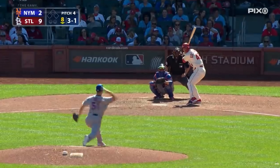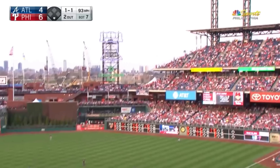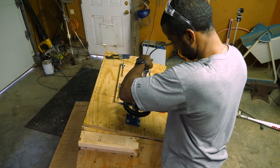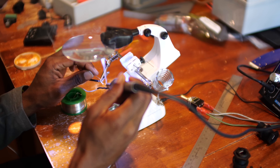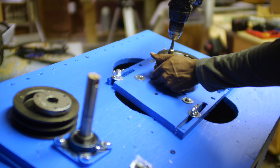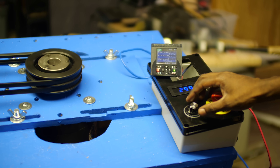We know that major leaguers swing the bat at about 90 miles an hour and so you get this exit velocity that's really high - a hundred something miles per hour. We have devised an apparatus. My buddy Jeremy Fielding has been working on it for months now. We've got a three phase generator hooked up to a huge motor and a pulley system that gives us the right gear reduction so that we can spin this bat at crazy velocities.